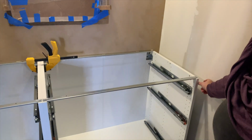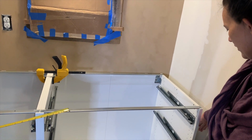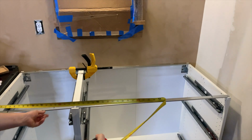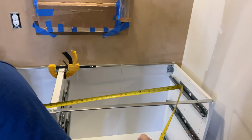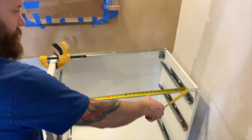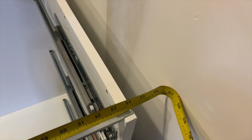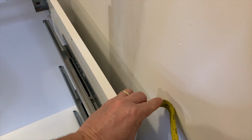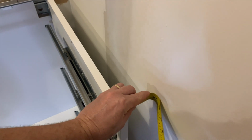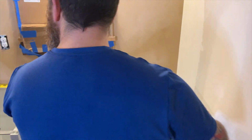Yeah. We're gonna put a wood block filler piece here, and then there's a piece that goes on the front to fill this entire gap. You went all the way from the edge of here. Here. So, I mean, it's close to 57, but 56 and a half would give us a little bit of clearance. And on this side, it's not going to matter because the shiplap is going to come down. So that's true. It doesn't have to be perfect.